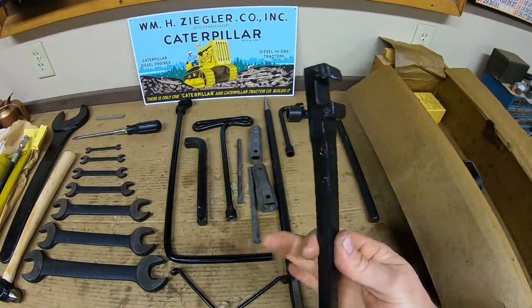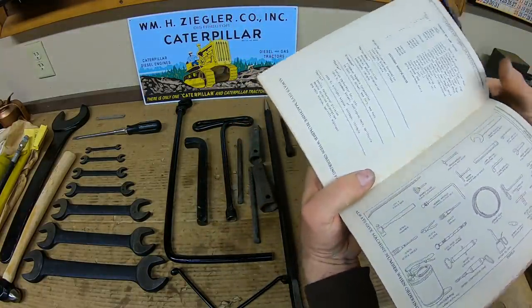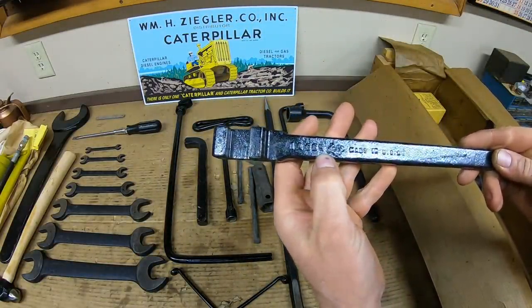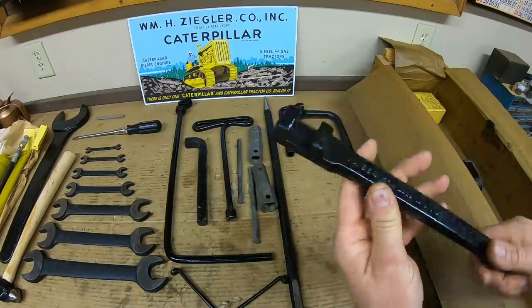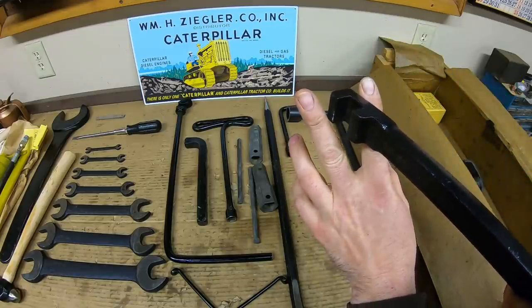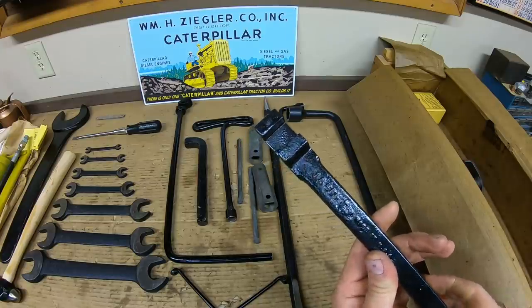Here's another interesting wrench. This one is definitely a D4 wrench — it's not in the 7U series book but I found it in the 4G series D4 or early RD4 book. It's listed as 1A665, wrench for track shoe nut. It's marked '1A665, Made in USA' and never been used. It goes inside the track link bridged between where the grouser bolts come up, and the nut is in between those bridges. Basically a binding bar to sandwich between the link bridge and get the nut — track shoe wrench.